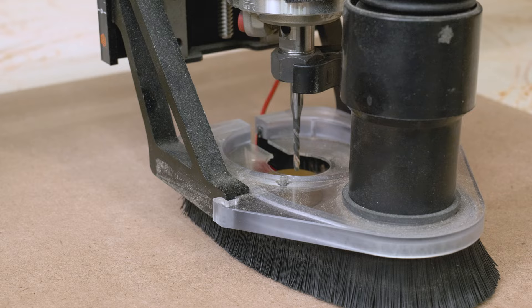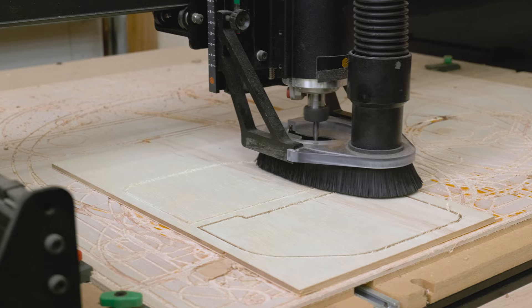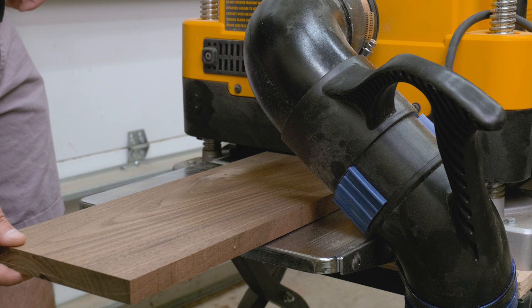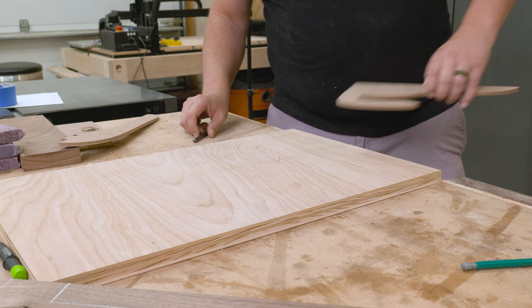While you could make these one at a time, I recommend templating them out of MDF so you can reuse the templates. If you want to make all these push blocks and push sticks yourself, I have a link in the description where you can download the templates for free, and for those with a CNC, I'll include the CNC files as well. I took my scrap walnut over to the planer and thicknessed it down to about three quarters of an inch. I like using scrap because lumber is expensive. Then I laid out my templates onto the stock, going for nice grain pattern and avoiding any checks and cracks. For the body of the hero push stick, I'll be using birch plywood to avoid any breaking from short grain to long grain transitions.